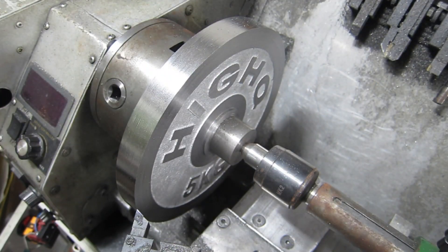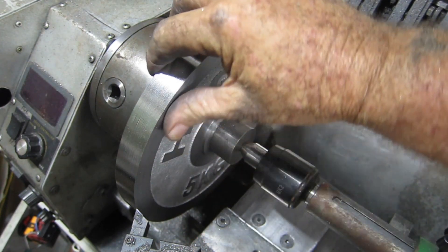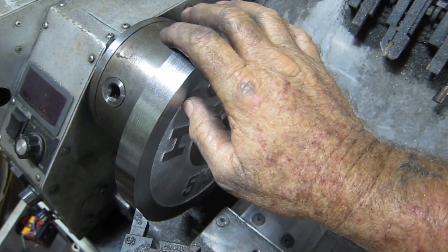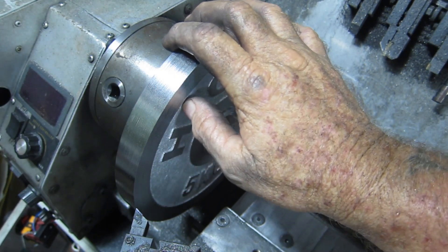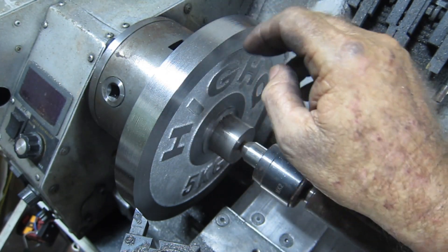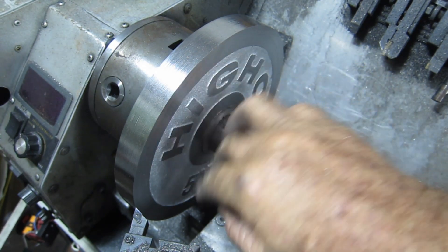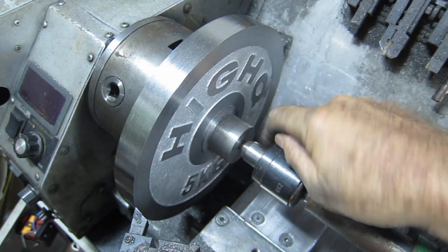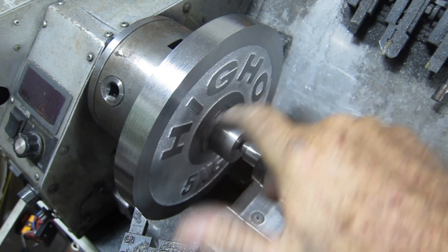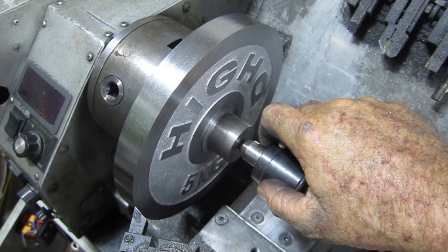Well viewers, these new tips are proving to be the duck's nuts. They're actually a ground tip — I think they're Mitsubishi, a Japanese tip, not a cheap Chinese tip. I paid $150 for 10 of them, which is cheap anyway. I've been plowing away this morning — I still have maybe two and a half to three millimeters to go to get this side completely flat. I can't get all the way to the center because I'm running into the live center, and I've played around with tool length and stick-out.